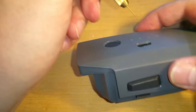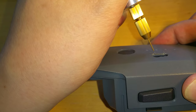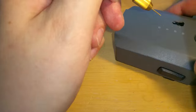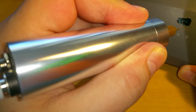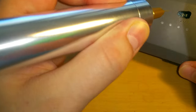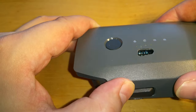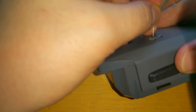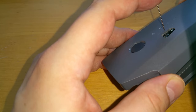Now drilling pin holes. Those must be placed on a line between the yellow dots, and we will drill under an angle — this will separate the pins at the top so it is easier to connect to them. While drilling we must see the diode to which our pin will be connected, so that we can create the hole at the proper place and proper angle. Once all the holes are ready, we carefully insert the pins, looking into the view hole to make sure they touch the proper contacts. We have to push the pins a bit down to make sure that the gooey substance used as an isolator is punctured and we really touch the actual solder.